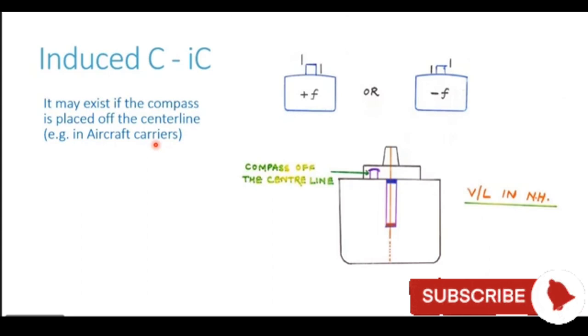Now in such a case, you can see in the diagram, the compass is placed off-center, and the ship's fore and aft center line bulkhead acts as a vertical structure. The induced magnetism generated by this vertical soft iron to port or starboard of the compass does generate induced C.